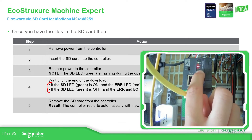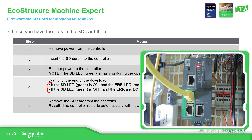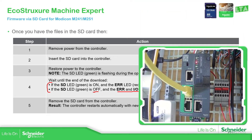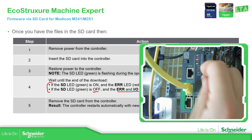Now you can see it's flashing. You have the IO LED on and the error LED flashing — this means the download has been successful. Another behavior you might see is all the indication LEDs flashing together, which would indicate a different state. In our case, the download has been successful, so we can remove the SD card.